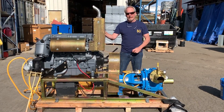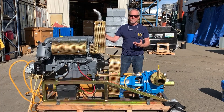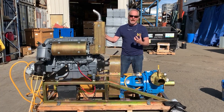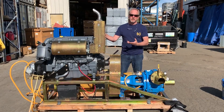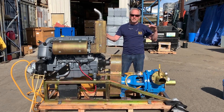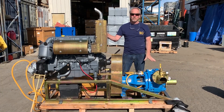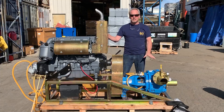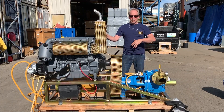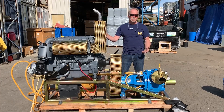What a gravel pump does is it allows you to pump solids long distances away. If I wanted to pump material up to 3.5-inch rocks, 1,500 feet away, no problem. I want to lift the material 50, 60, 70 feet above the water level, I can do it. And that's what a 4-inch gravel pump does. These are not inexpensive systems — they're designed for a more professional type contractor who wants to pump material long distances.